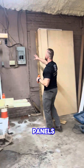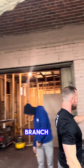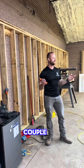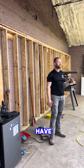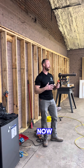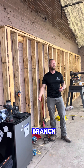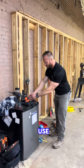Coming out of these panels, we call them branch circuits. Right now we've got this wire coming across — this is considered a branch circuit to this wall. In a home, you'll have at least one branch circuit feeding a bathroom, and typically at least a couple bathrooms. Every single kitchen has to have two branch circuits, each on a GFCI breaker — this is just code. Another great tool we use, of course, is a meter.